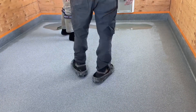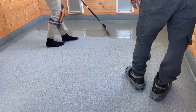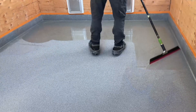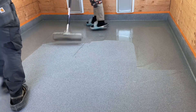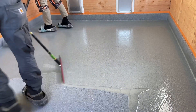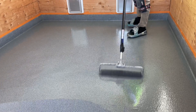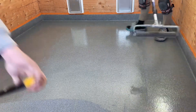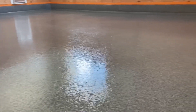The flat area of the floor is pretty straightforward: pour down the material and use a flexible squeegee to pull it across with only medium pressure. The idea is to fully saturate and fill the absorbent quartz as well as to create some amount of mil thickness along the top surface — some overlap will help with this. A back-roll with a quarter-inch epoxy glide roller helps to relax the material and let it cure at a hopefully uniform appearance. And that's about it — epoxy quartz with a polyaspartic topcoat.